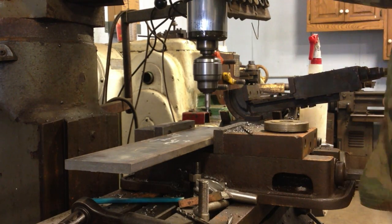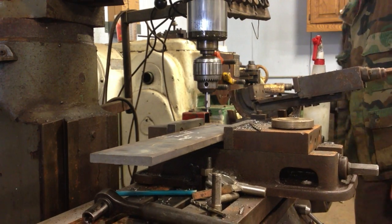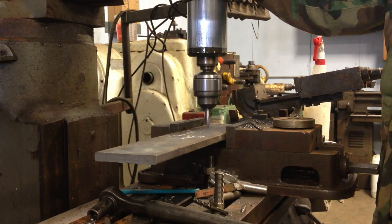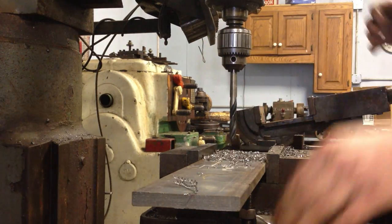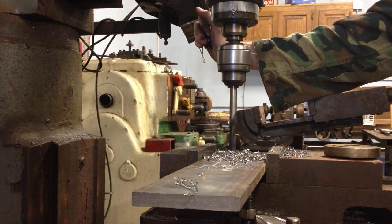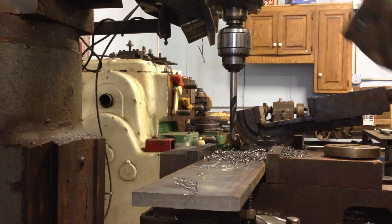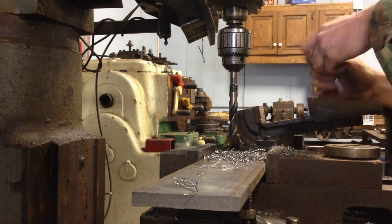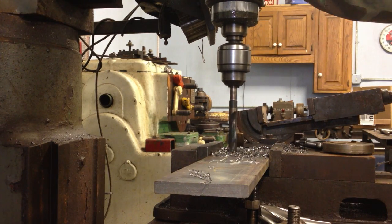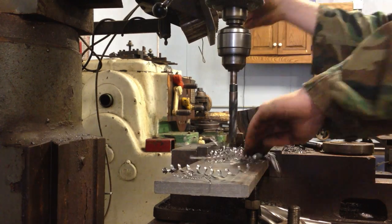So I sped up the drilling. I started with, I think, a number 6 center drill, and I drilled 3 holes. And then I didn't show an intermediate step, which was a 1/4 inch drill bit that I ran in the chuck, so that these would drill better or more quickly. And that's a size bigger than a 1/2 inch there, which was actually the wrong size. It needed to be 9/16. But I corrected that later on.